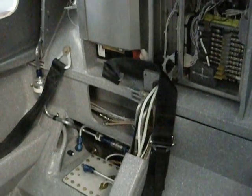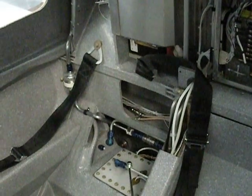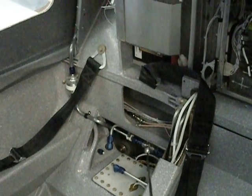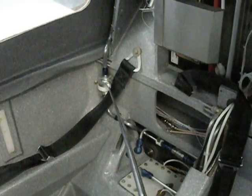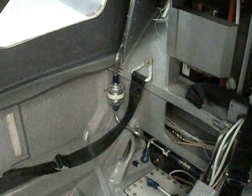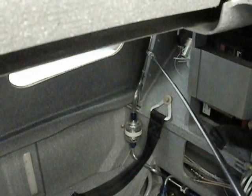Let's get back to the pressure fuel system. The fuel comes out of this three-eighths inch line here under pressure — 34 pounds per square inch above manifold pressure, and I'll show how that happens later on. It routes through the fuel valve across here, and then I have my first filter, which is a 10 micron filter. It's available from Aircraft Spruce, and you can replace the element just by taking it out and washing it.